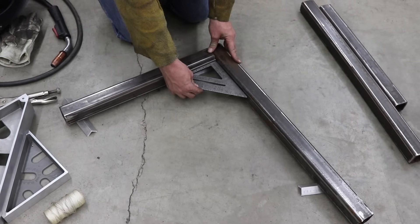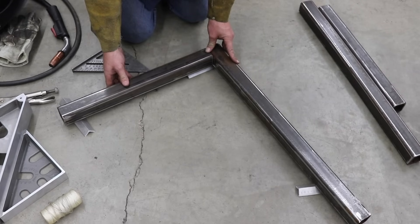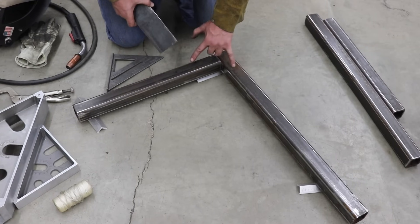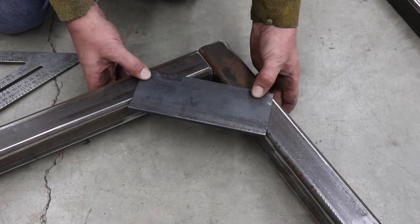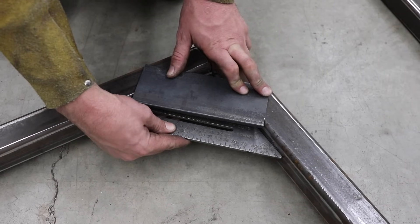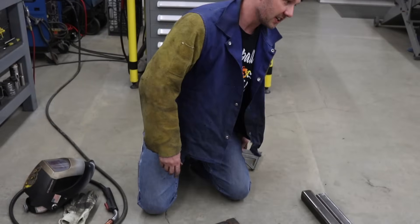So we have our speed square. We can adjust it to 90. But the problem lies in just that — you see this twist? We can eliminate some of the twist by matching these two flat surfaces, and we can get by with that by clamping a flat surface there. And now we just have to worry about 90, and then we can tack away. So that's what I call the hard way, so we don't need this.